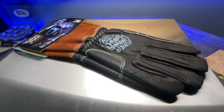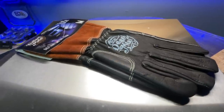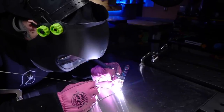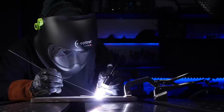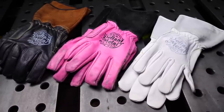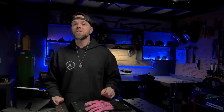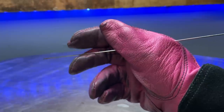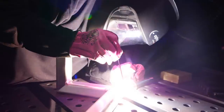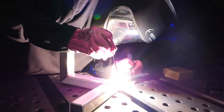Personally, these are my favorite gloves — these are from Defiant Metal. I have used these for years, even before I was sponsored by them. They are genuinely one of the best welding gloves I've ever used. They fit my hands perfectly and come in a couple different colors. But do some research — find out what brand or fit of gloves works best for you. You need to make sure that you can feel the material you are working with properly. Feeding filler material with your hands is a vitally important part of TIG welding. If you're welding with gloves where you can't really feel things in your fingers, trying to learn how to feed filler material is gonna be tough. Having gloves like these are gonna give you great dexterity — you can feel everything really well.